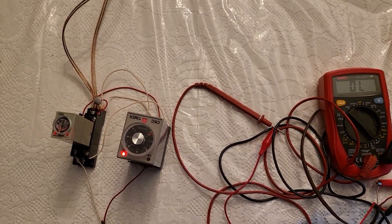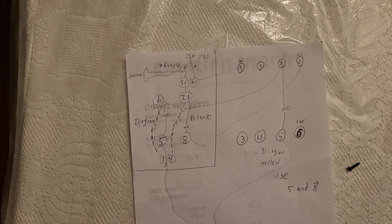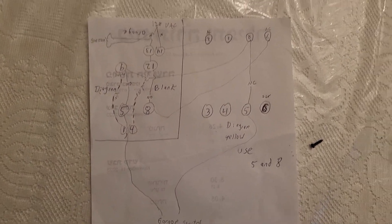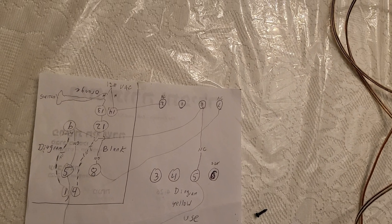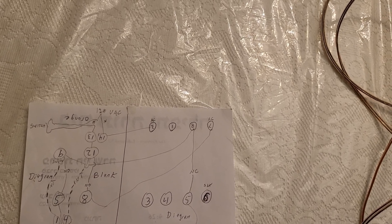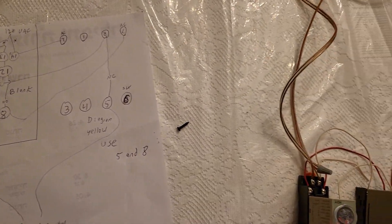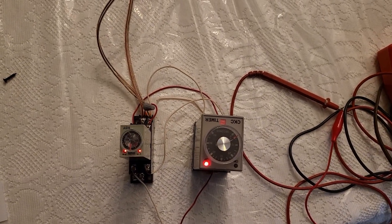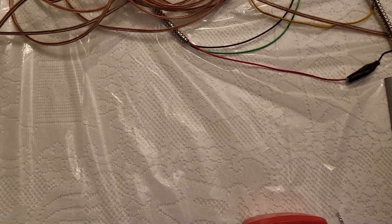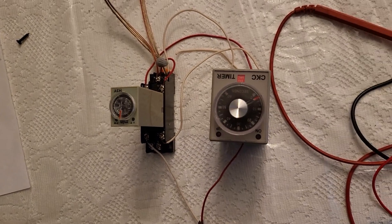Let's go back to the diagram. The first relay activated and closed terminals five and nine, and then five seconds later the normally closed terminals of five and eight opened up. For the duration of the time the garage door is open, it's going to stay like this. Now I'm putting this back down to simulate the garage door closing, and as I do that all relays shut down and it's back to the way it was.